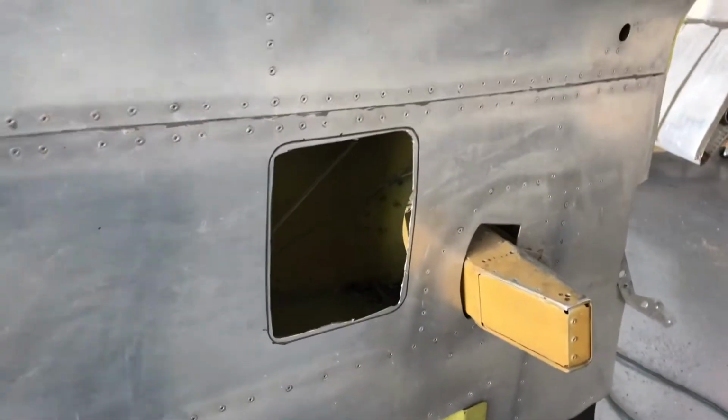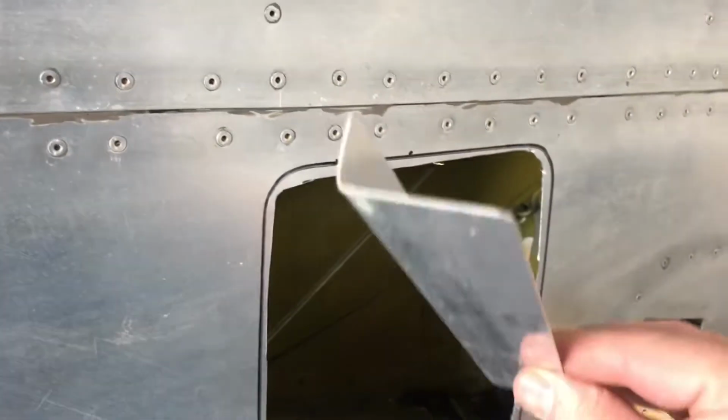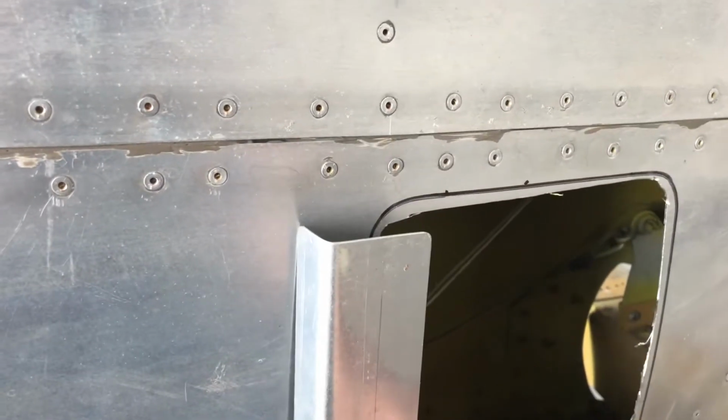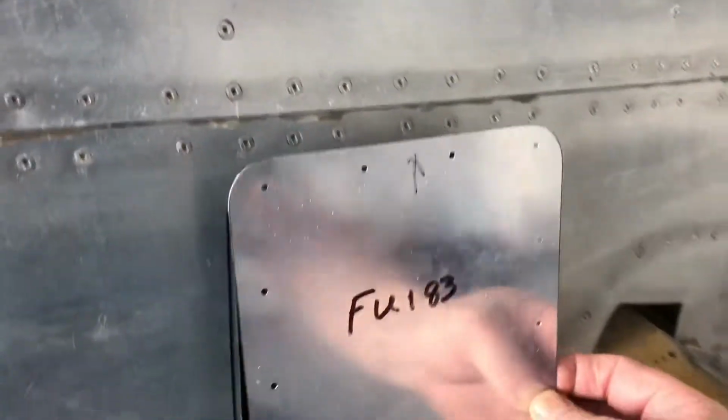All right, so the hole for the horizontal stabilizer inspection is done. We can actually look in there and see the assembly, see the stuff I have to vacuum up now. There's the cable for the elevator up at one, and then these are for the trim itself. I've got a little trimming to do to get up to that edge, and then these supports, the 90-degree bend, go in, rivet in from behind, and then they get marked for the screws so that this will fit flush over the top with recessed screws.